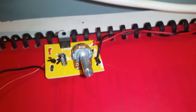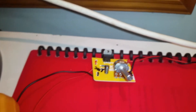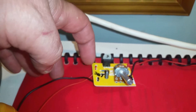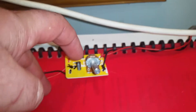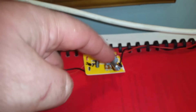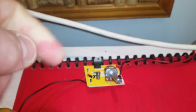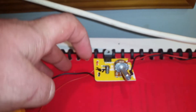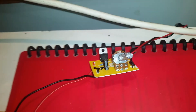I created my own little speed control fan control circuit using an LM317 variable voltage regulator — very simple circuit. Basically an LM317 voltage regulator, and between the output pin and the adjustment pin, which is pin one and two, I've put a 510 ohm resistor. Then between the negative ground bar going back into the output pin I've got a 10k potentiometer or trim pot — pretty much the same thing. I've got an electrolytic capacitor and a ceramic one just there as you can see.